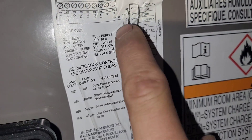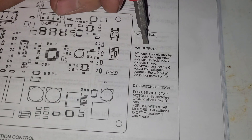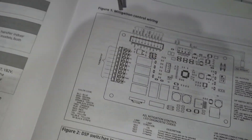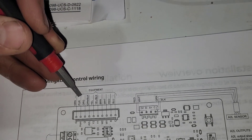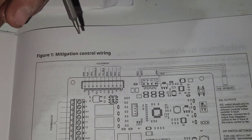You'll have this A2L output wire — that's only for equipment that has an A2L terminal. If you have an A2L terminal on your control board then you would hook this A2L wire up to your control board. In this case we don't, so we're just going to use the green wire right here and hook that to the G terminal on the fan.